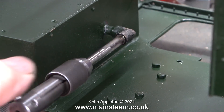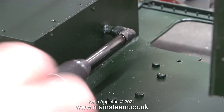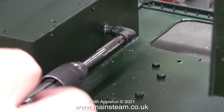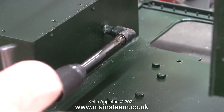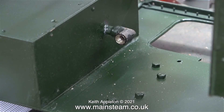There was however a problem with the water outlet from the hand pump. The pipe was the wrong way around — it had a union cone and a nut sticking out, and the nut was damaged. I chopped off this extra piece of pipe that was soldered into the end of the elbow, and here after drilling it tapping size, I'm using a quarter by forty threads-per-inch tap to thread the hole.